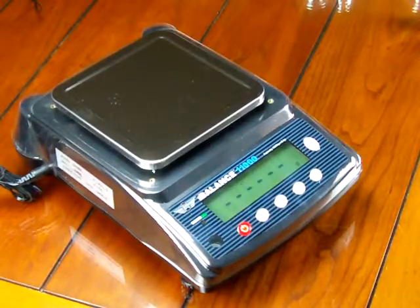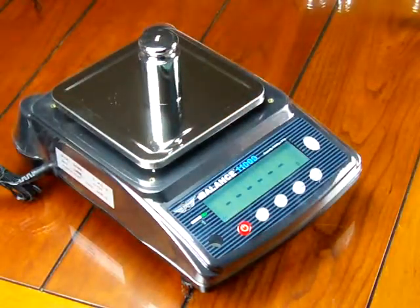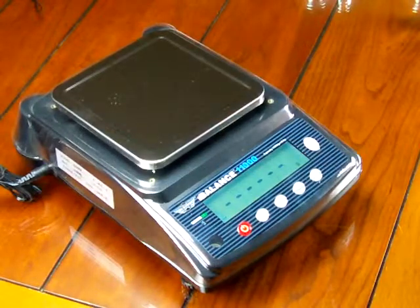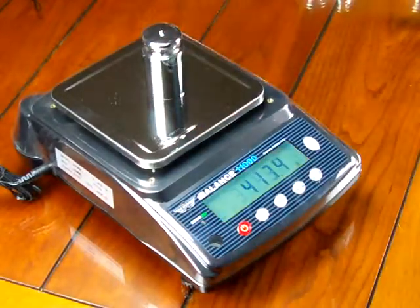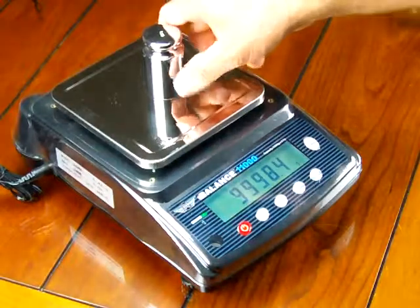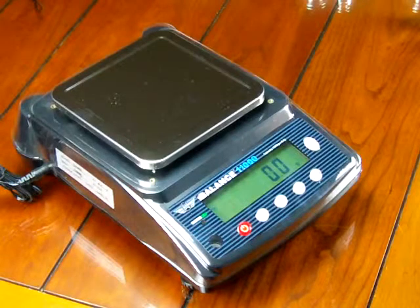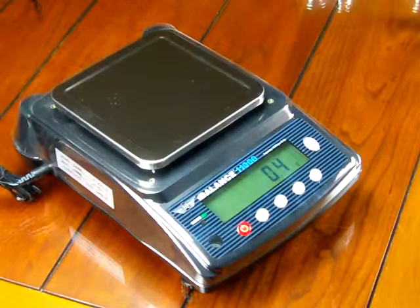This time I'm going to use 500 grams. It's showing — give me 10,000. I'm going to put 500 grams on the scale. The balance is actually accepting 500 grams as 10 kg. So now if I put on the 500 grams, it's showing it as 9,998.4. So it's a big issue that if anybody ever goes into this balance and does the calibration without the right calibration weights, the balance is going to be off, and someone will say the balance is defective. It's not defective — it needs to be calibrated.